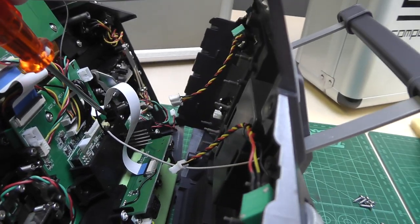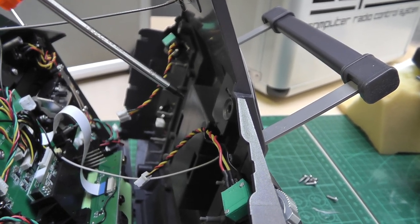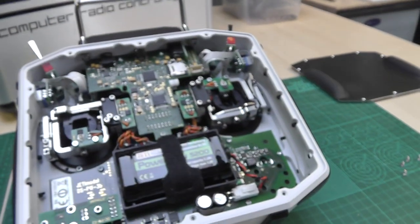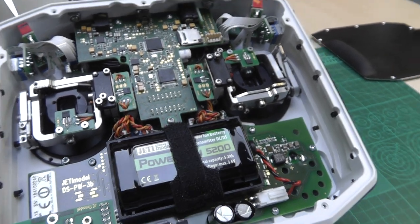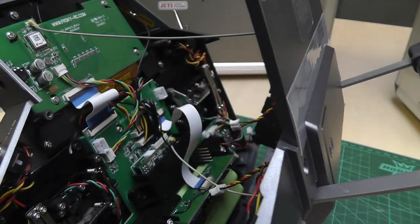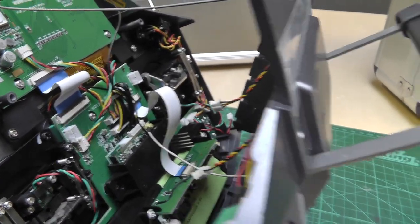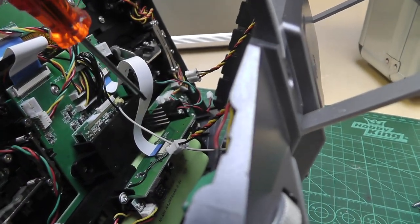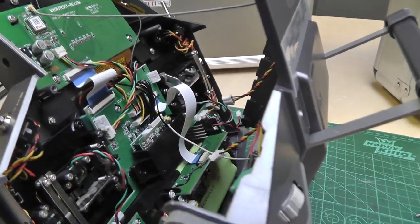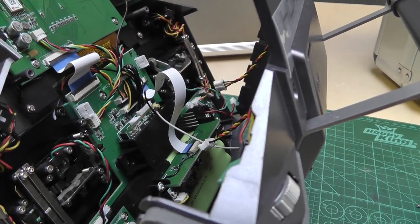And the external antenna connector will go to the outside of the Horus, so you can connect an external antenna, and you can actually use them both at the same time. So then you have one module with two antennas, the same as the DS16, one module with two antennas, but this one has actually an extra module with two antennas. So two modules, four antennas, and here one module, one antenna, but if you want, one module, two antennas. So it is possible. And if you want the same as the DS16, you have to add an extra external module to get an extra RF module with one antenna. So it is not exactly the same, but you can achieve almost the same as the DS16 with the Horus, but then you have to buy an extra external module.